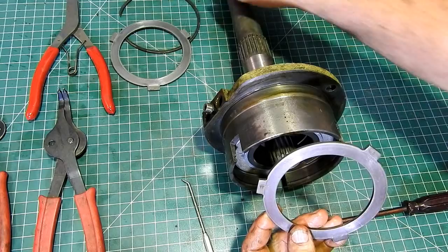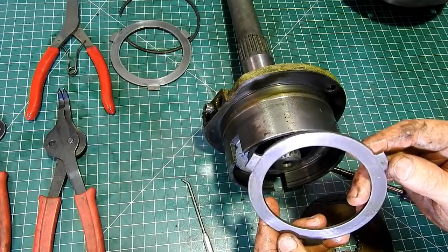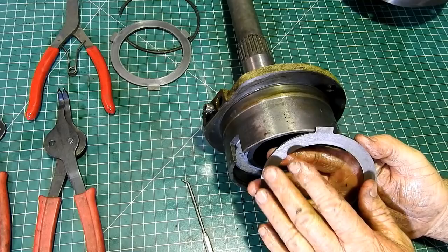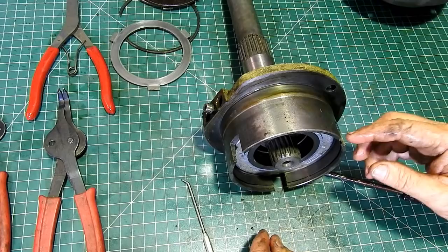Next off is the plate that rubs against it. Now what we look for here is — you'll notice there's no shine on this side, it's quite dull. And then you'll notice on this side it's a bit shinier. All that tells us is this is the side that the piston pushed on, and this is the wear side — this is the side that it wore on.